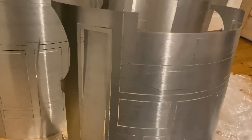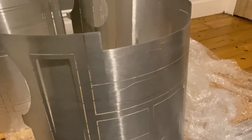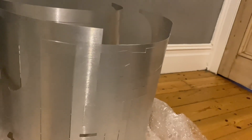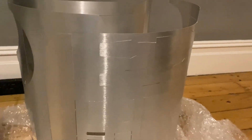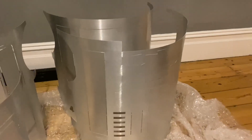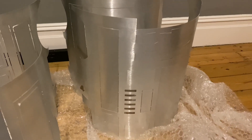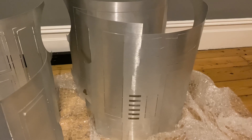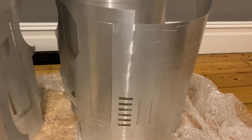Here are the skins. You have an inner skin and an outer skin. The inner skin connects to the frame — this aluminium skin screws or uses captive bolts onto the frame. I'm using an aluminium frame. If it was a wooden frame it could bolt straight on. With an aluminium frame you have to have skin blocks, then screw those to the frame, and this skin will screw into the skin blocks. You can get 3D printed skin blocks that work perfectly well — that's probably your cheapest option.